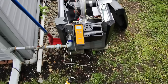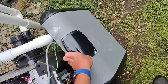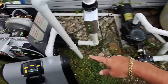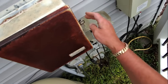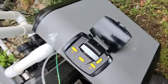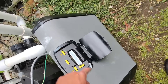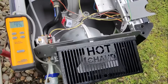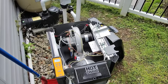I'm just doing my due diligence right now, making sure it has everything it needs to run properly. Power is off to the pool heater. Doing the startup sequence — pool heater is off, press pool/spa, water is 71 set for 90, it's piped up on everything. We're reading 7.1 inches of water column right now.